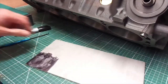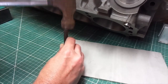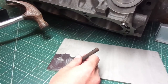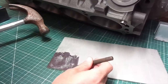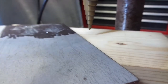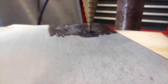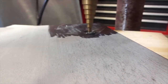Should have waited a bit longer for the permanent pen to dry. Centre pops — that means I'm drilling. I think I might be listening to Led Zeppelin as well, don't tell anyone. So drill — let's try out the step drill on 5mm stainless. Let's not forget the lube. The camera is between me and the press drill so I'll knock it in a minute, I'm sure. Make sure the centre pop was aligned, and off we go.